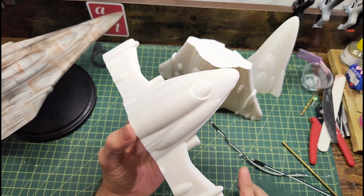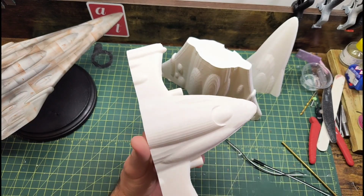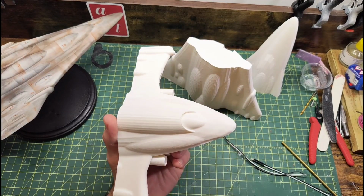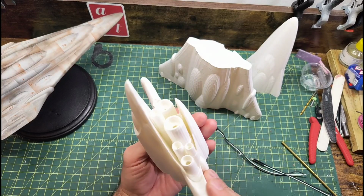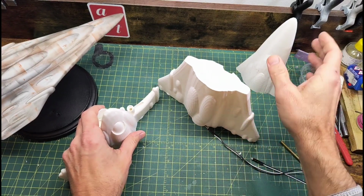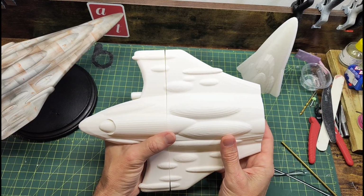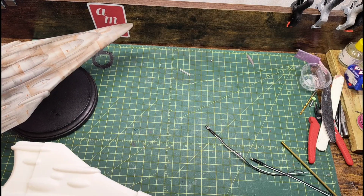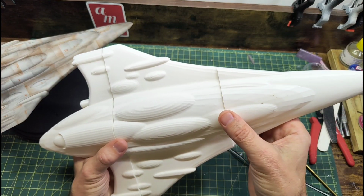And Thingiverse is great. I use it to print these things, and I'm really just building my skills on printing these things out. So the next step is I actually start purchasing some better files that I don't have to do all this processing on. But this has been great to learn, to get that learning curve of filament printing down, working with it, how to slice it. And again, this one was sliced into 3 sections. I believe this was 300% the original model size. And so when you get it all together, I think it comes up to probably 17, 18 inches long. So it's a nice size.